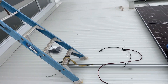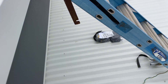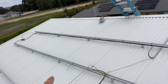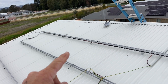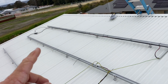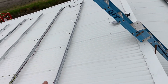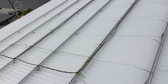In summer, obviously, the sun will be more directly above us, and the shading will be more to here, so they won't be shaded. I've got another string of 15 panels here, and that will be paralleled with the other one. Now, that is getting close to my short-circuit current on the inverter — very close. However, they're different orientations, so they're never going to peak at exactly the same time. So I'm going to be fine there. I've done that many a time, not an issue.